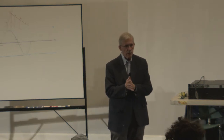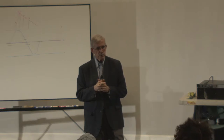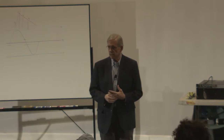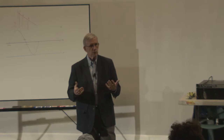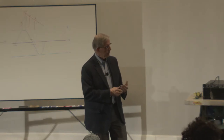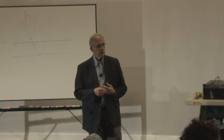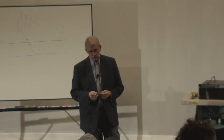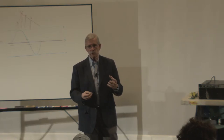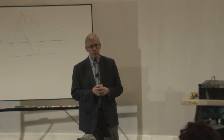Plus the fact that high frequency drivers are not rated like woofers are. When I was a young guy, high-frequency drivers were rated at 10 watts, and then they went to 30, and then we found some that are 40. Now I still don't think they're much past 100 watts. Yet they put out all this sound, whereas woofers can be rated up to 1,000 watts or so. In the session we do on loudspeakers, I've got some cutaway speakers that have been ruined. You can see how they go together, and you can see the difference in the wire sizes and the coil sizes on the woofers compared to the tweeters.